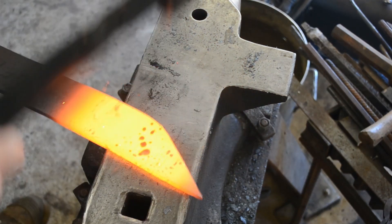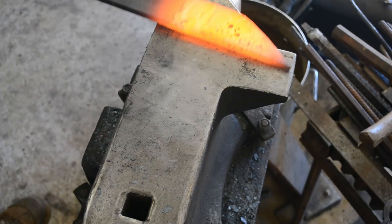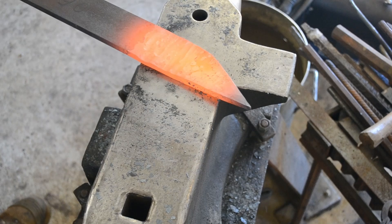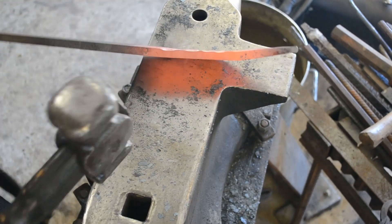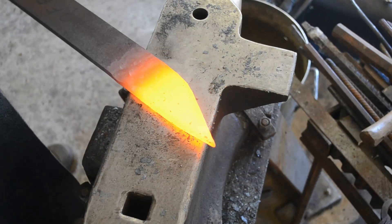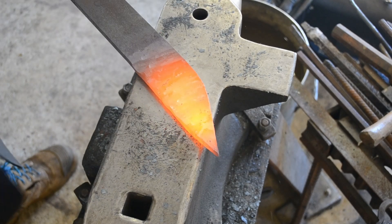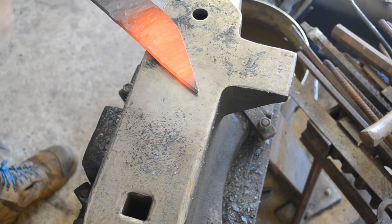Now that I have the tip shape that I want, I'm going to move to my straight peen which was made for me by Hans at Charming Hollow Forge — go check his channel out, I'll link it in the description — and I'm just going to start drawing out that material. Light blows at the base and heavier blows out towards the tip to try and increase the distal taper. I'm only about halfway down the blade. I don't want to do a full length distal taper from ricasso to tip in this case because the blade is so long and so thick at the ricasso. So I'm only going to taper half of the blade, and then as I do my bevels I'll actually end up doing a full distal taper from the ricasso. This stage just helps before beveling — getting that material stretched out gives you your final tip profile as well.